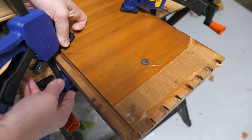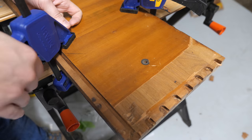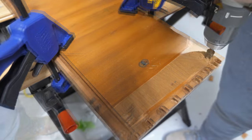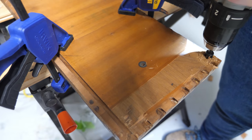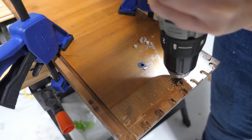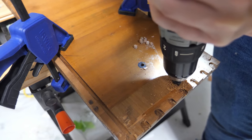After drilling out some of the larger holes with a 1/4 inch drill bit, I cut plugs using the drawer front that I kept from my previous Ugly Duckling project. I just peeled back the veneer on the drawer face, and the wood looked close to the top of the desk.